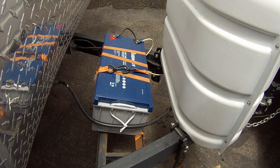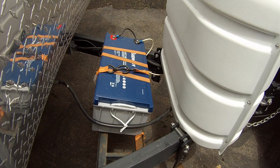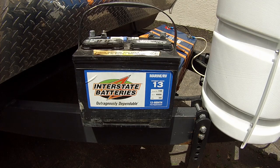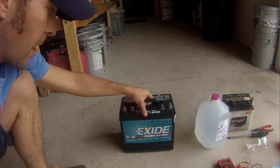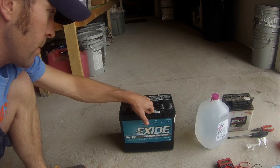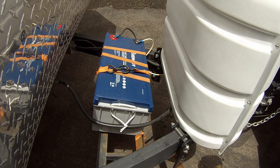I'll throw a screenshot of the specs on screen, so feel free to pause here. One of the main features of this battery is that it can deliver a thousand cycles at 50 percent DOD — which is depth of discharge. In comparison, if you buy a normal deep cycle battery from Walmart, the lower you drain that battery the worse it will perform in the future, and if you drain it too low you may ruin it entirely. That is where this battery really excels.